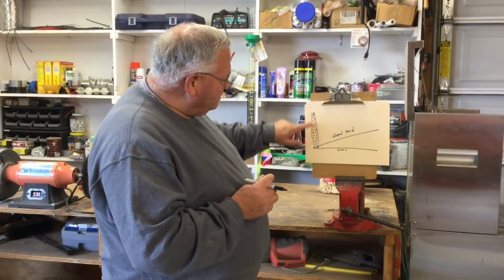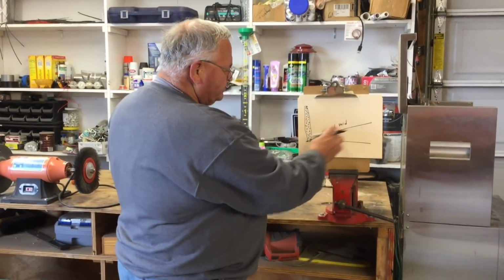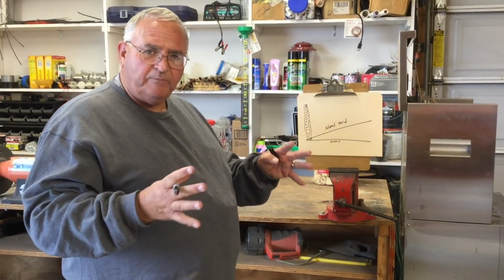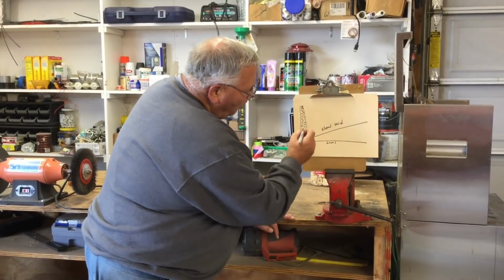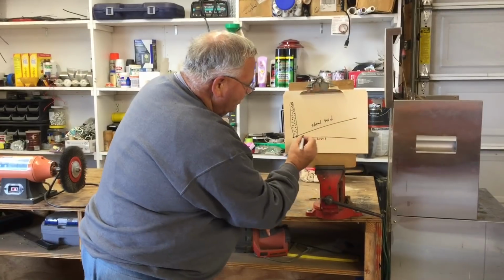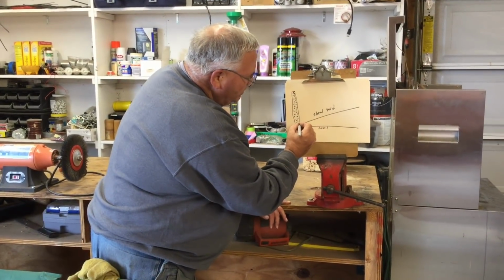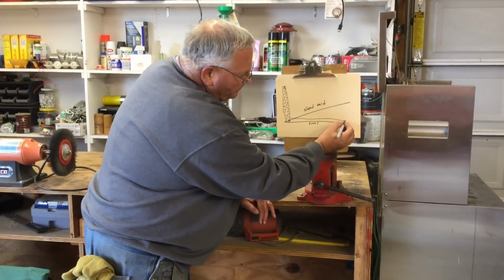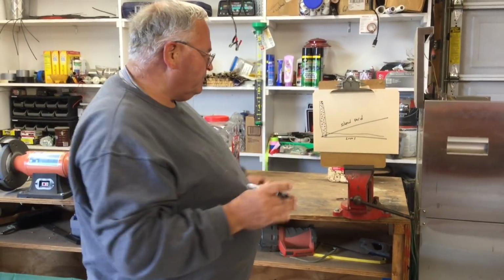So I put in the French drain this way, and as the water runs this way, it falls into this French drain, and this French drain had a perforated pipe in it that would collect that water. And then I actually ran more perforated pipes this way with more French drain. And what you need to do, if this is level, then when you run these other lines, you want to run them so they have a little bit of fall. About 6 inches per 100 feet is probably enough for this.